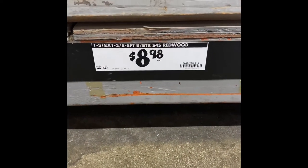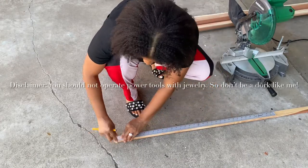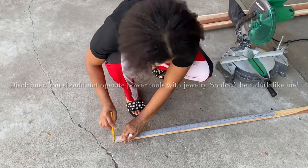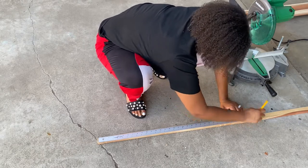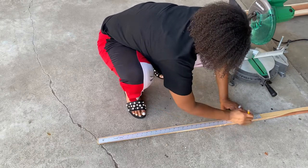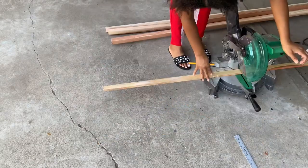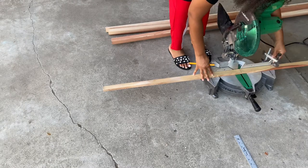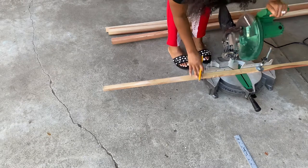When I was picking the wood I tried to pick the slats that were mostly a lighter color, not so red. Now that I got the wood back home, the first thing I did was take the one-by-twos and cut them to the length of my shower — no point giving you exact measurements since yours may differ. You'll need to do this twice, as these will hold your slats together.